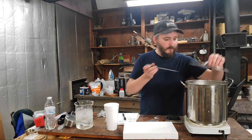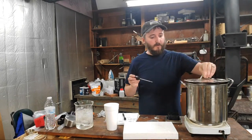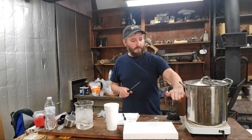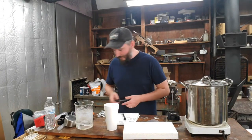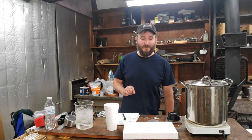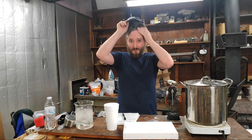Let's see what the water temperature is in here. Currently at 63 degrees Celsius. I don't need to get it exactly to boiling. It's kind of a tall order to boil this container of water, about half full, on that little electric burner. But I do want to make sure that it's warm enough to actually fully melt the phase change material. I don't really have much doubt that it's going to be able to melt the ice, but if it doesn't melt the phase change material, then I won't get a complete measurement.